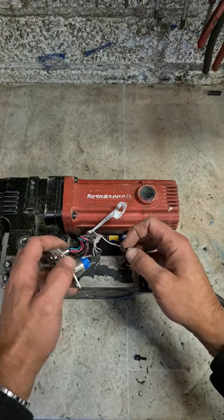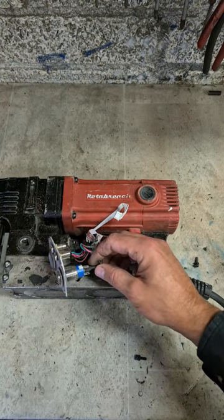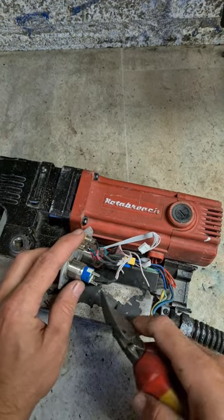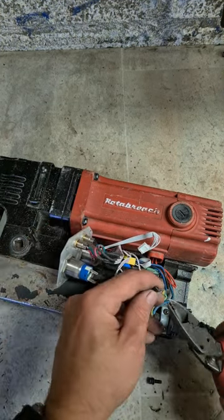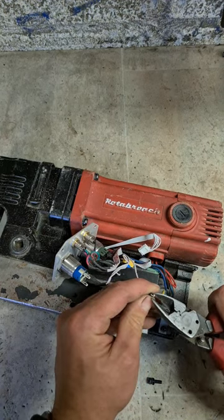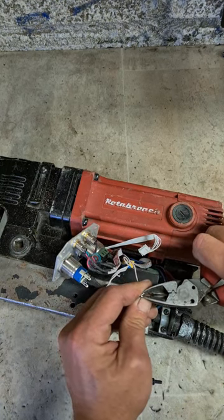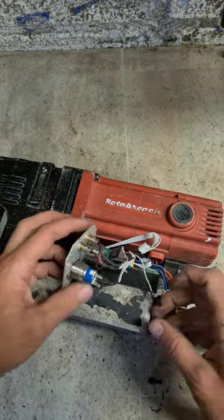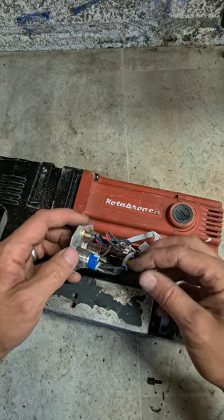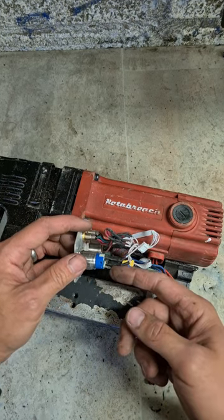One connector off. That's off of there. First problem — this wire's pulled off. There are two connectors; not sure which one it came off of. We don't get an awful lot of Rotobroach in and I don't have a wiring diagram for them. Going by some of the older models, there needs to be a power line up here — normally there's one up there and one down here.